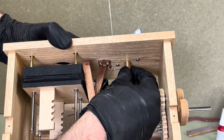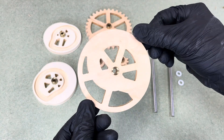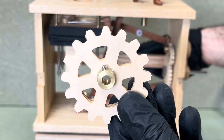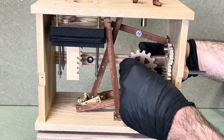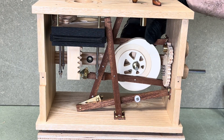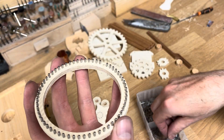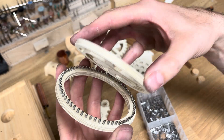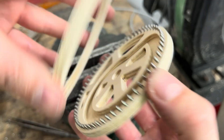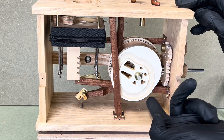Laid out now are the cams and gears, each fitted with brass collars secured using M4 grub screws. I begin by inserting the first shaft into the rear support, adding a nylon washer followed by the smaller of the larger gears and then a double-sided cam profile. I make sure the cam followers are seated correctly into their pocketed profiles. Next comes the large pinned gear with a single-sided cam profile — these use needle rollers which you can buy separately, inserted using a guide that lets you drop the rollers into place and press them in using a vice. This gear connects directly to the drive handle. Finally I added another double-sided cam profile to complete the first shaft assembly.